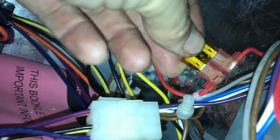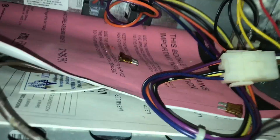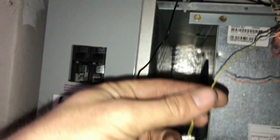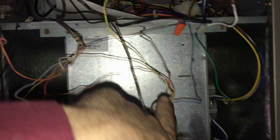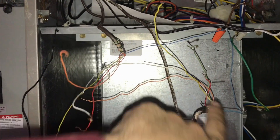So now I need to actually isolate where the short's happening. You can see the fuse has blown — evidence we've had some tries figuring this out. I put a new fuse in, hooked it up — bam, instant short. The thermostat's off the circuit, so that can be eliminated. What I do is disconnect our wires and isolate the outdoor unit from the indoor side, going through our thermostat. It's just a process of elimination from there.